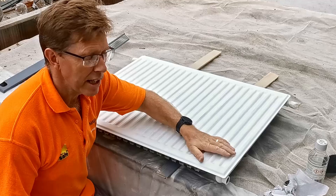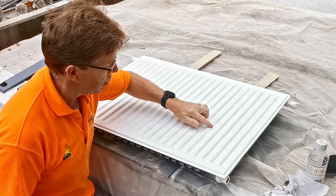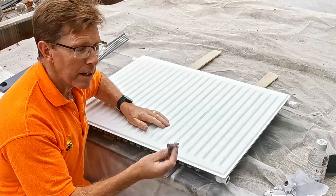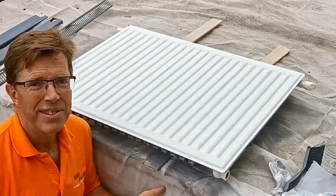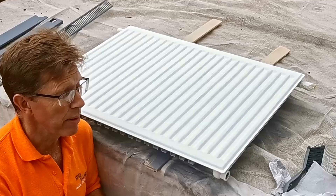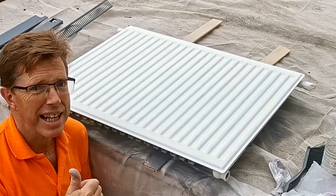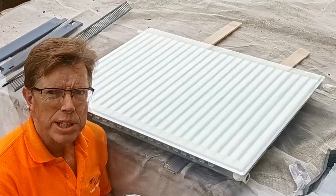Now I'm back to the white hall radiator. Although I sprayed it white, I wanted to keep it white and spray it with a sparkle too. But it didn't quite cover up all the marks where the metal is showing through. If it had been a newer radiator I wouldn't have all these dark marks. So I've got to go back over again with more primer — I'll key it up first by lightly sanding with Scotch-Brite and then it'll be ready for more white primer. I'm not a painter or decorator — this is definitely not the definitive way of doing it, just a method I decided to try.